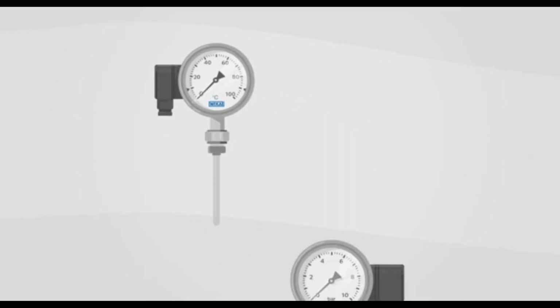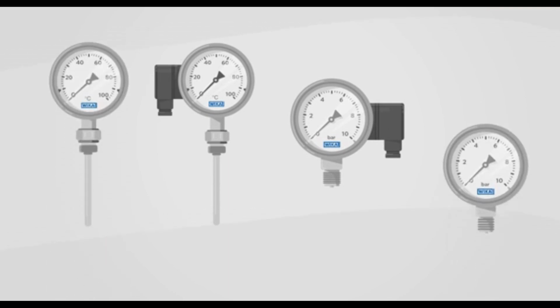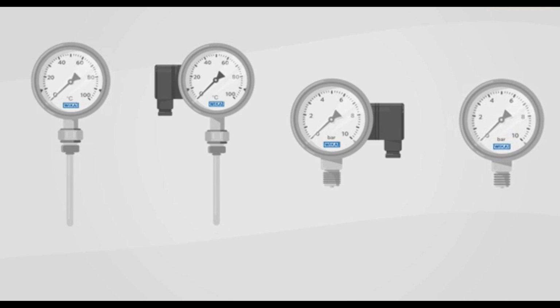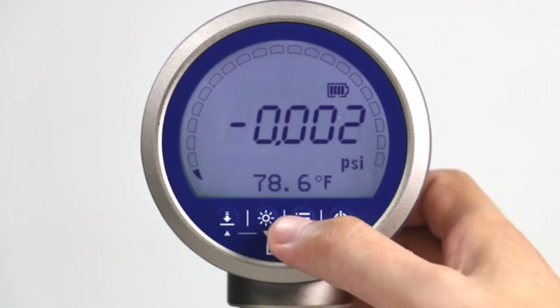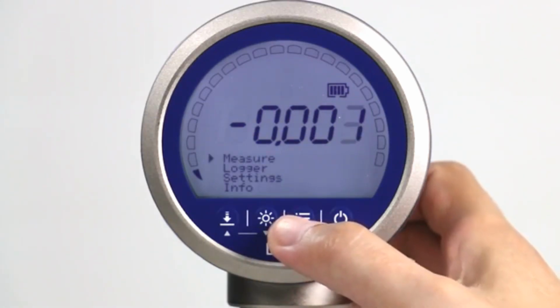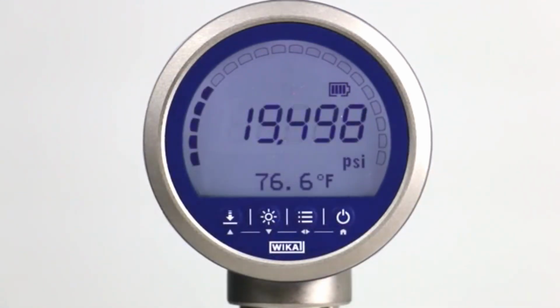4. Choose the right type of gauge. Bourdon tube gauges, suitable for high-pressure applications and general industrial use. Diaphragm gauges, ideal for low-pressure measurements and corrosive environments. Digital gauges, offer high precision and ease of reading, suitable for modern applications requiring data logging.